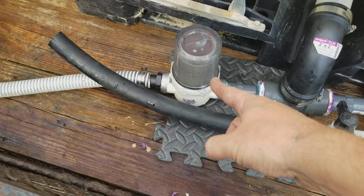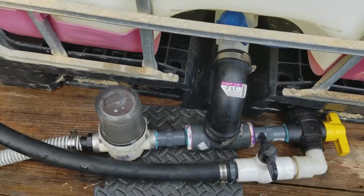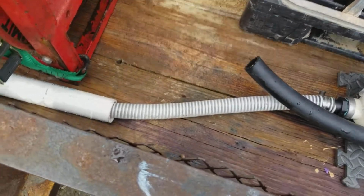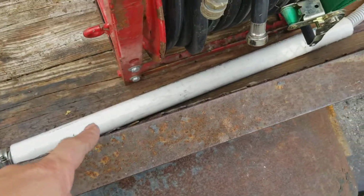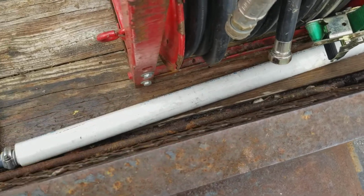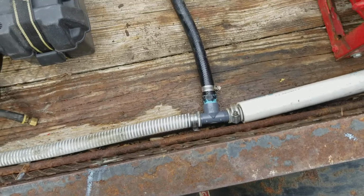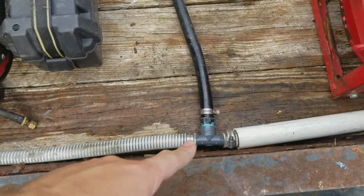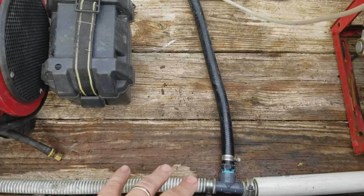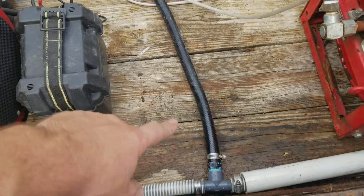We got our bowl filter. I will put a Y filter before the pump on that one. So we got that coming through here. I did put this section inside of some pipe so that if it's rubbing up against that or this sidewall, I just didn't want it to get damaged. And then ended up dual feeding this one. So we've got 1-inch line, 1 inch here. It does require me to kind of get flow going first for really to see any advantage of that.